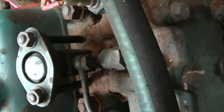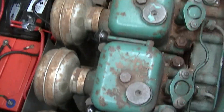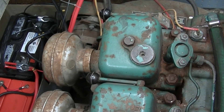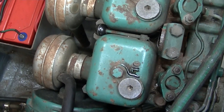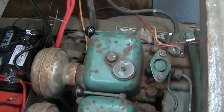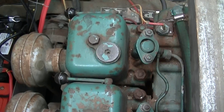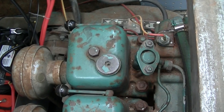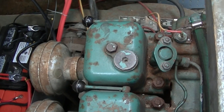Here's an injector — a typical injector right here. I like this engine because it has separate cylinders and cylinder heads. If you had a bad valve, broke a ring, or had a problem on one cylinder, you don't have to tear the whole engine apart or take it out — you just disassemble that one cylinder. That also means you can carry a spare rebuilt cylinder head, cylinder, piston, and rings with you. It's entirely practical to carry a complete top-end cylinder assembly if you're cruising far away.